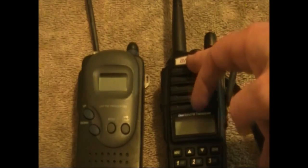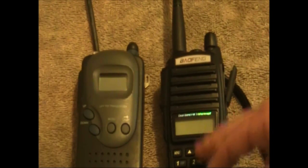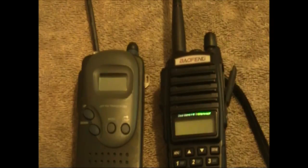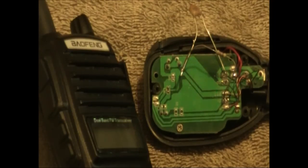I used two UHF handhelds. This one, as a receiver, when it picked up a signal, produced audio which triggered the VOX setting which most modern handhelds have. That setting caused the other unit to transmit, and you could therefore hear a signal from it on the distant handheld whose range was being tested. That worked but required two handhelds. This video describes a different range tester.